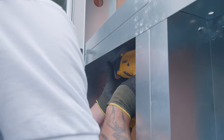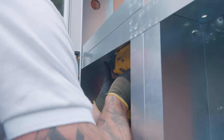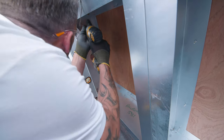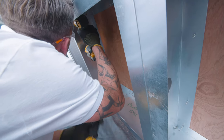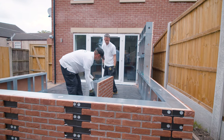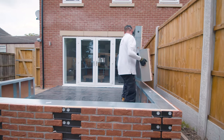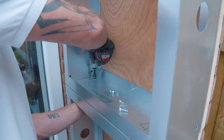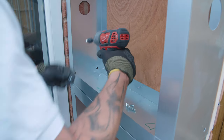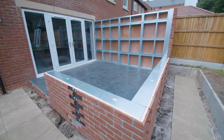When it comes to securing the wall sections to the exterior of the property, first drill a 6mm pilot hole, having first checked for hidden wires or pipes. Then attach the wall sections with the 50mm direct-to-brick fixings. In this example, there is a full-height wall, however not all conservatories will have this. If your bespoke conservatory requires a full-height wall, use the 25mm nuts and bolts to build the wall upwards. You have now fully constructed the conservatory base and can move onto the frames.